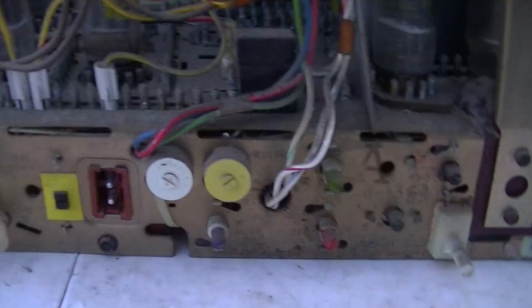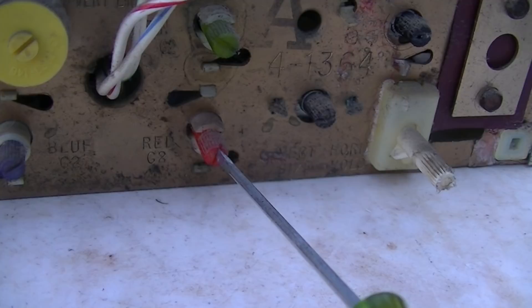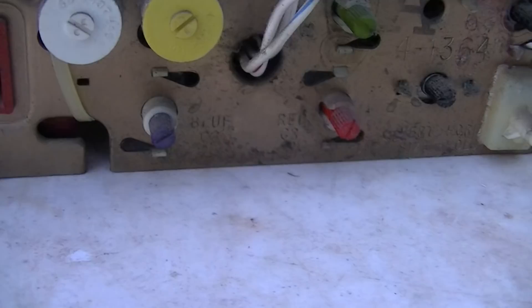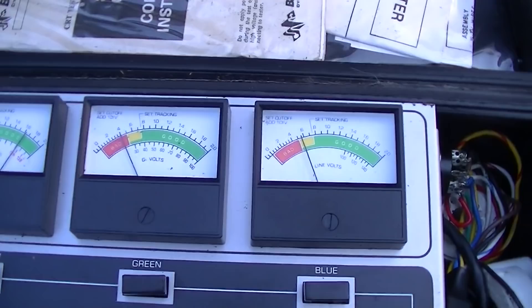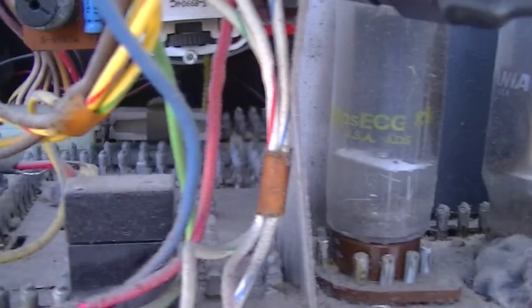Green is about wide open, red was about 20 degrees from wide open, and blue is wide open. Interesting — so this one has a tired CRT. You can also tell it's high hour; a lot of the vacuum bulbs have been replaced — Sylvania. You can't tell the condition of a vacuum tube by looking at the envelope unless the getter is white — that's the only time you can condemn a tube based on what the glass looks like on the inside.